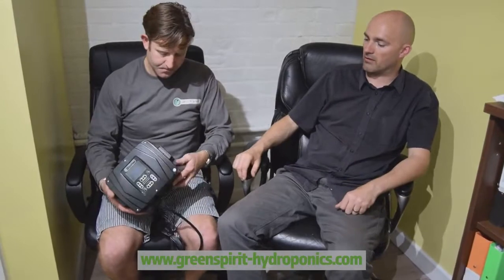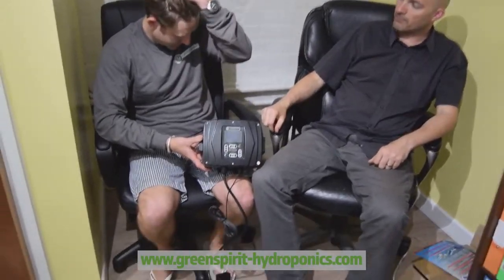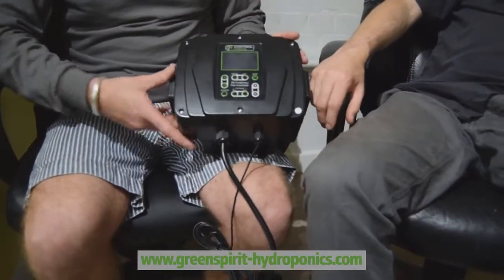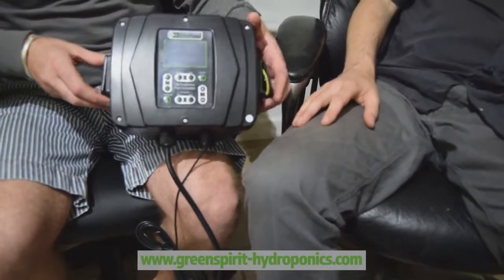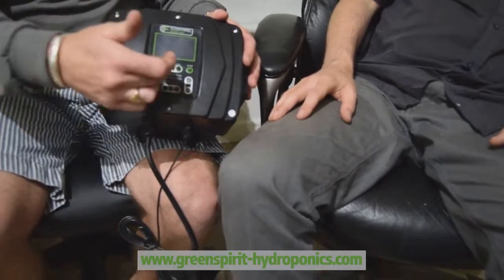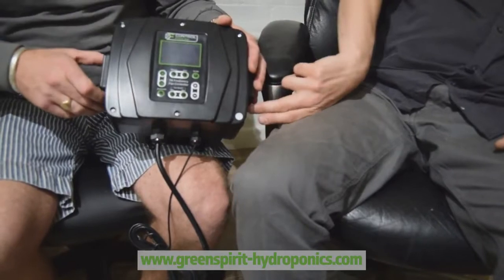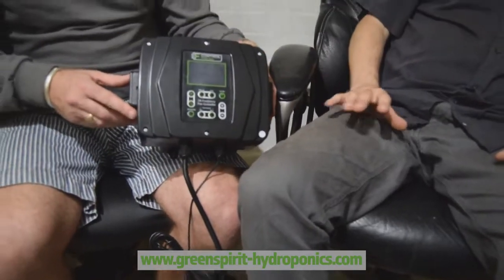It's fundamentally the same thing doing the same job. You've got two plug sockets, one and two — it's a multiple fan speed controller. But it will actually run as many fans as you want, up to the amperage. So if you've got a 7 amp, you could have multiple fans plugged into both sides up to 7 amp. You could have a 4-way in here with 4 fans, a 4-way in here with 4 fans, as long as it doesn't surpass the 7 amp, 13 amp, or whichever amp you go for. What it will do is the same thing to all the fans.